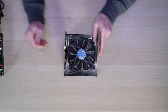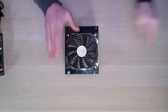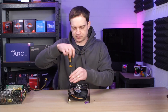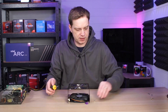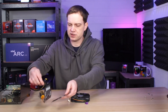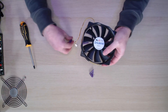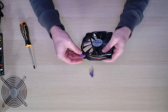If we take a look at the fan, this is obviously not a Cooler Master fan — it's a Zalman, so somebody changed it at some point. We'll take the fan out and show you what they did to the corners. Simply remove the screws from the fan and it will drop out into a big mess — just like that. We'll pull the screws out and put them to the side. We want to keep the fan grill because we obviously want to put that back so we can't touch the fan by accident.